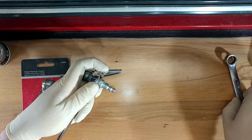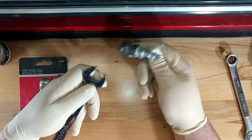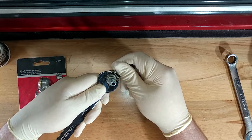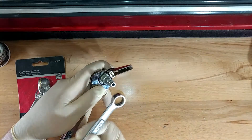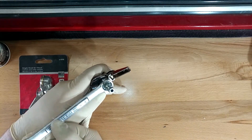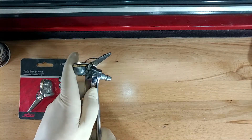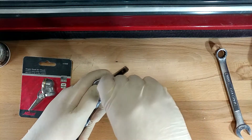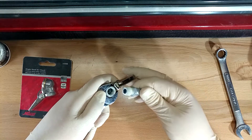There's nothing wrong with the fitting. This one happens to more or less fit a three-quarter inch wrench — it's not perfect, but it is what it is. Let's see if we can get it broke free the same way we did the last one. That actually wasn't even that tight, so I'll take the blame for cracking the fitting, but it may just be a poor quality part. So there's our fitting out of there.